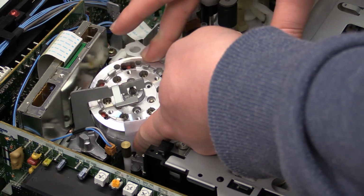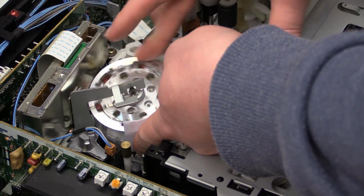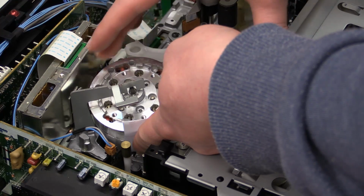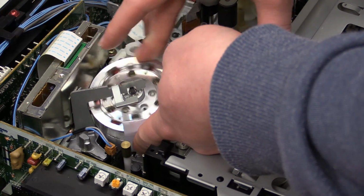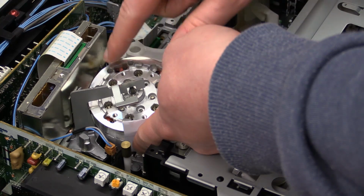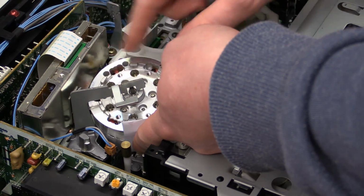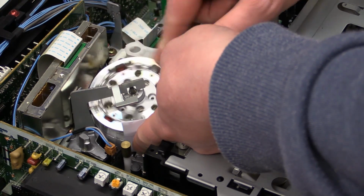And now you just go ahead and you turn the head drum manually, obviously. And you can actually feel the heads gliding across the paper on the other side. You can feel them. And you are cleaning them as you spin the drum. And I'm probably going to edit this video. I'm going to turn it for a while, and then I'll be back.